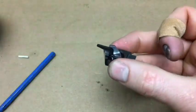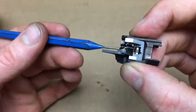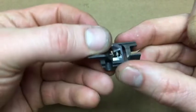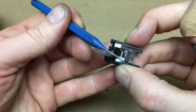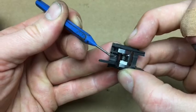It's important to make sure that while you're attempting to do that, the tip of the sear spring is down in this groove, because that will make the pressure of the spring a lot lower and be less likely to push it off to the side. So now the sear can rock in there. The tip of the spring, one tip's back here, whether you've cut that notch or not. The short leg's there, the long leg's in here.